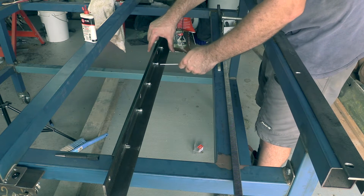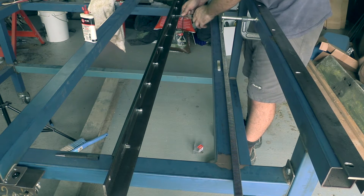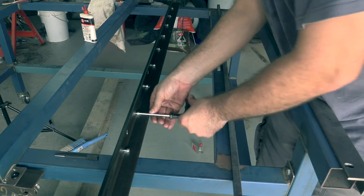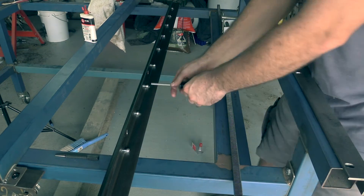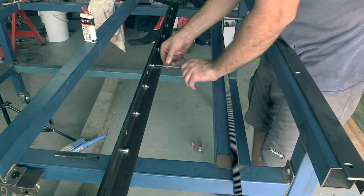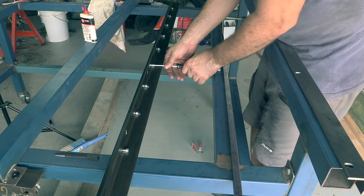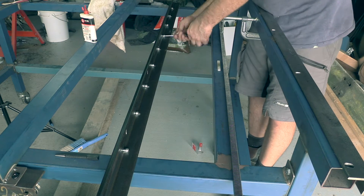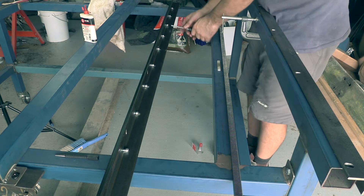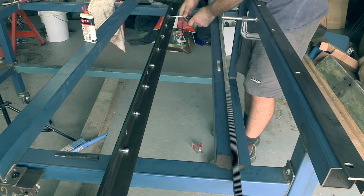Fingers crossed — I'll slowly work my way down along the line. Now the reason I'm doing it this way is because if I ever have to replace the rail I don't have to grind off my rack. I was worried about warping it, or if the rail edge gets a massive ding and I have to replace the rail, I don't want to cut and grind these off all the time. Also I don't really want to introduce heat to them because they're hardened — it'll throw out the temper.